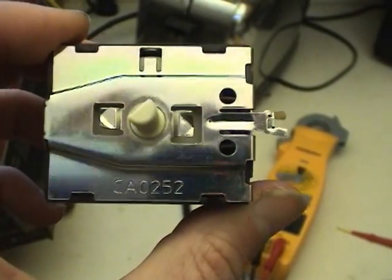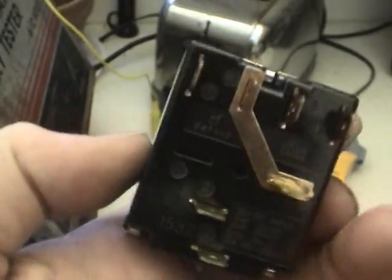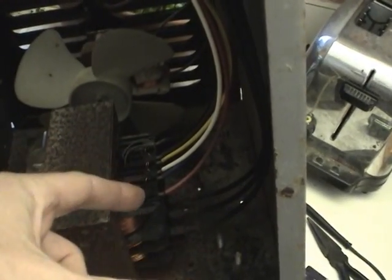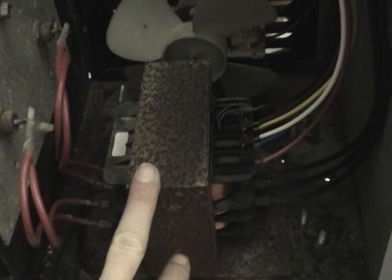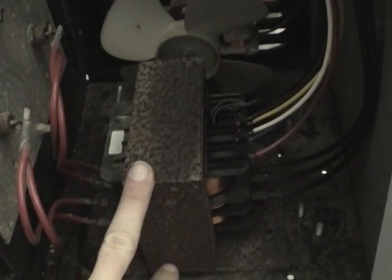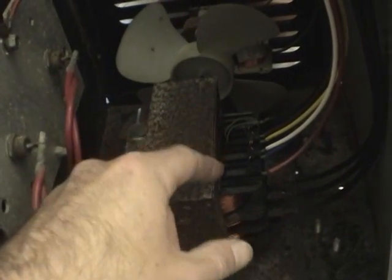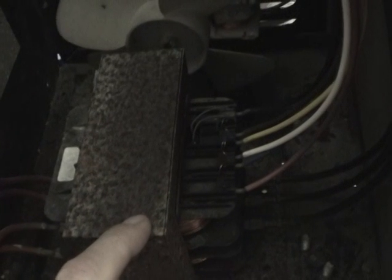I sourced this from Century Tool. What I ended up doing is just studying everything in here and figuring out that what this mode selector does is basically select different taps on the primary of this large power transformer. It's kind of a weird setup - it acts like it has two secondaries in series with each other and a single primary with multiple taps. It looks like it's very well designed. They have what probably is a thermistor down inside here making contact with the primary winding or maybe the core.